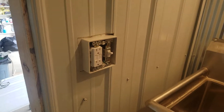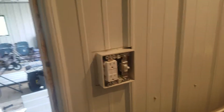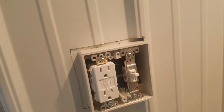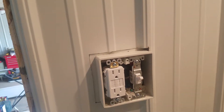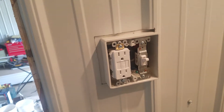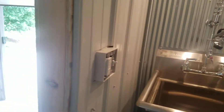I do something kind of unique — I use these siding boxes, and you can actually see that over here on my wall. I use a deep siding box, and there's an actual new construction box underneath, a full big 4x4 one. I put one of these siding boxes on, then put the tin over the top of that. It gives me something to mount the switches on and adhere them to.